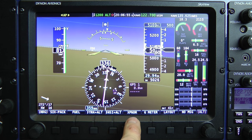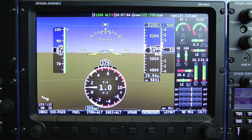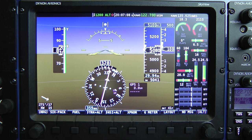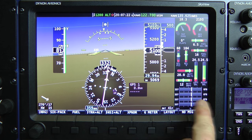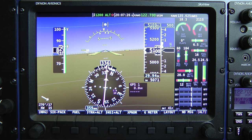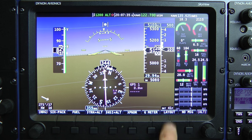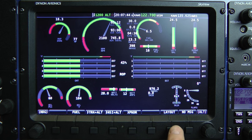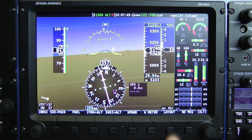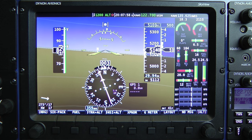Button 5 is the transponder control we discussed. Button 6 is a one-button control for turning the G meter on and off — pressing it causes the G meter to overlay the directional gyro, and pressing it again makes the G meter go away. Finally, button 7 is the layout button. We've simplified the screen layout options in Skyview SE. Because there is no mapping display, your only choices are flight instruments and engine. Button 7 cycles through four screen layouts: 80% flight instruments / 20% engine, 50/50, 100% engine instruments, and 100% flight instruments, then back to 80/20. Through experimentation you'll find you're never more than three button presses away from the screen layout you want.